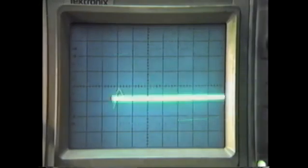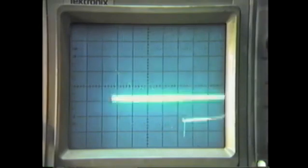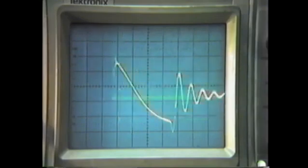And that's what it looks like. This is the important part, is what's up in the peak of the spike, or the resonant peaks. It only happens when you use a spark gap connecting with a neon tube, an Ne2 or something equivalent, as long as it's a gas tube, that the spark can jump the gap through a condenser and then across the neon.